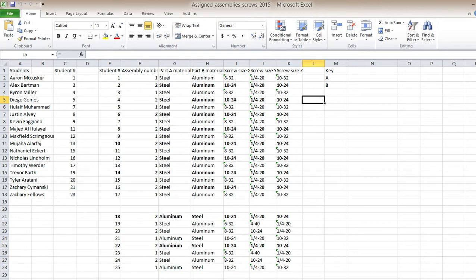Yes? You said at one point that where we drill the holes is super important. Oh, correct. Thanks for reminding me. Yeah, so if you notice my drawing, I say about 0.2 inches from here, about 0.8 inches from this corner. Those are just approximate, as long as the assembly kind of looks like this. I'm not really grading on the location of these holes. This is only focused on the correct size drill bit, spindle speed, RPM, everything for the actual hole itself.